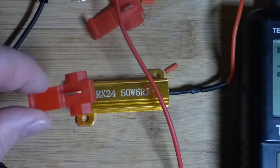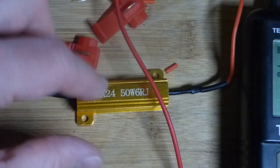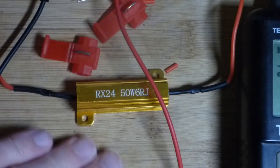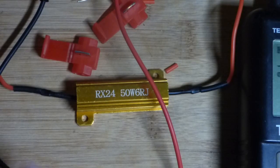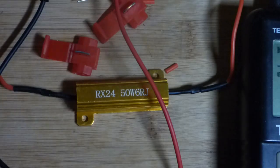There are all kinds of people selling these. I found what I think is pretty close to the cheapest. You can attach the resistor to metal right there — that will help dissipate the heat. Wood made it warmer; metal would have spread the heat better if there was more of it to connect to. There's also thermal paste to help get the heat to dissipate, but we're not going to go into that. Just a quick thermal test.